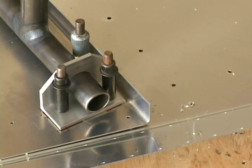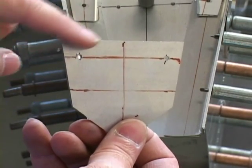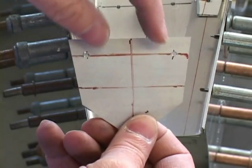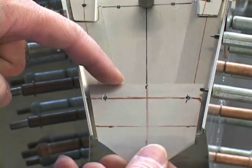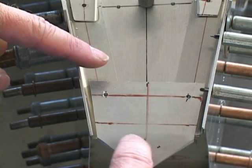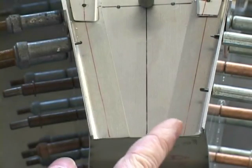We'll drill these out to the full size after we reattach the Longeron underneath, so that we can drill that all together at the same time. We'll prepare the upper hinge by locating two pilot holes about 10mm back — don't make them too close to the edge. We can lay this in place and then adjust as necessary. Remember, the bend is to line up with the edge.